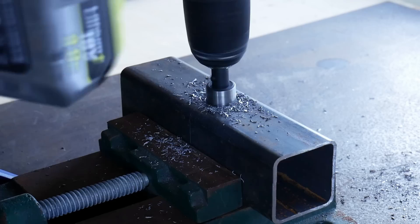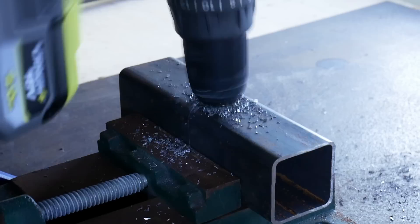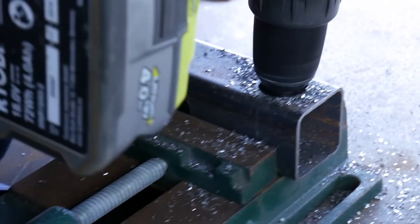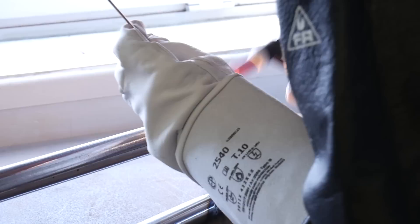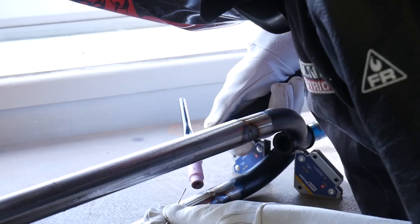I'm drilling some holes using a hole cutting saw so that I can make a hole for a big axle and also some even bigger holes so that we can put that tube in which is 30 millimeters on the outside. I've had a TIG welder for quite a while but I'm a bit out of practice — it's been about two years — and this is round which is a bit more tricky than straight lines, but the weld should be sound enough even if the welds aren't going to look particularly pretty. I just welded all that round to fit the extensions onto the existing front forks.